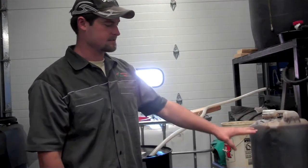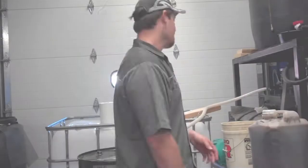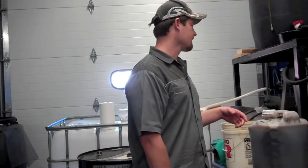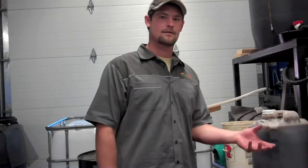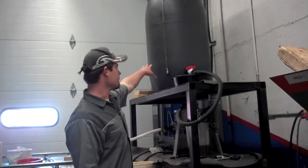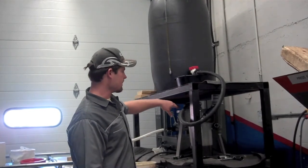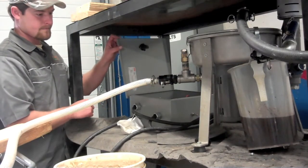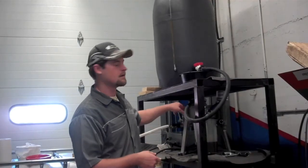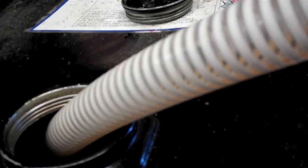The first step in the process is getting all the crud out of here, whether it's particulate matter or moisture. What we're going to showcase in the workshop is basically what this unit does and how it's economical compared to other options. You take your raw oil and pump it up into this containing jug, let it flow down, and the centrifuge spins out any of the heavier particles — heavier than oil — that'd be water, the batter. And then the output is clean oil, clean enough.